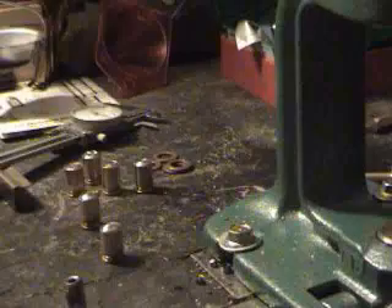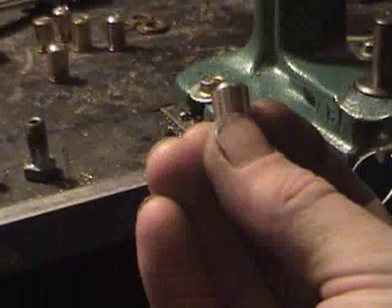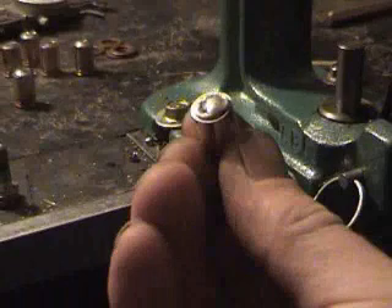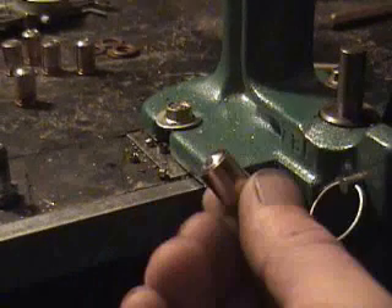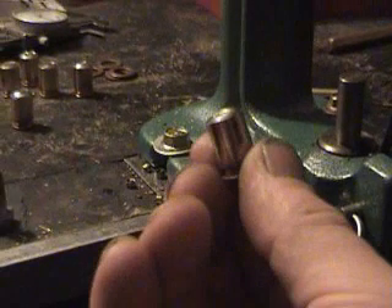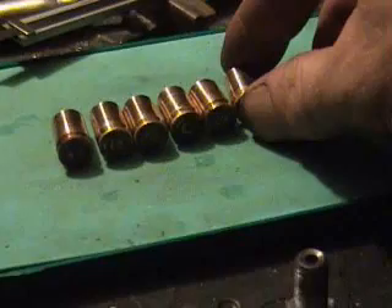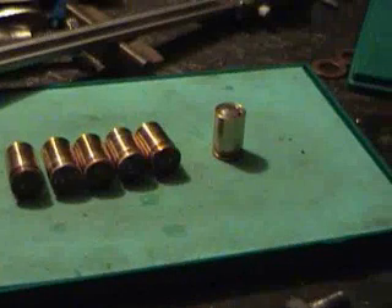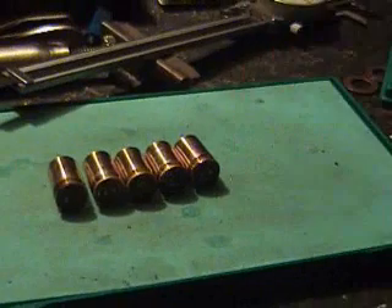Let's give this a shot. What I did is I took them — they are the same ones I just dumped the lead and they cooled off. I put them in the collet for the Lee trimmer and just ran some steel wool on them in a cordless drill to polish them up a little bit before I run them through the sizer. Let me get these lubed up then we'll give her a go. I just used a normal lube pad with the RCBS Case Lube 2 — it seems to be working for me. Maybe some Imperial Sizing Wax might work a little better but I haven't had any problems yet.